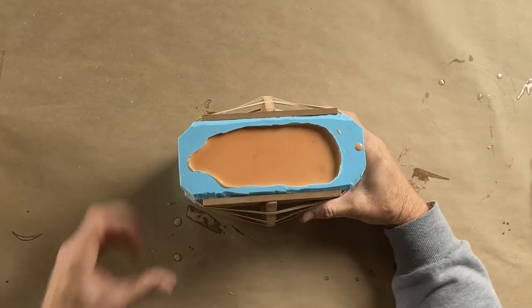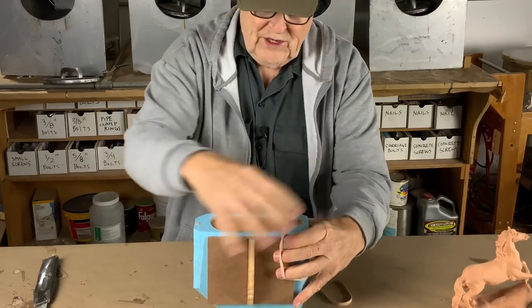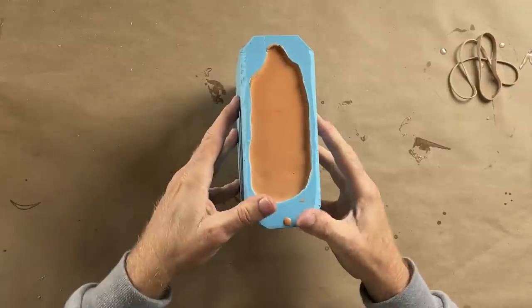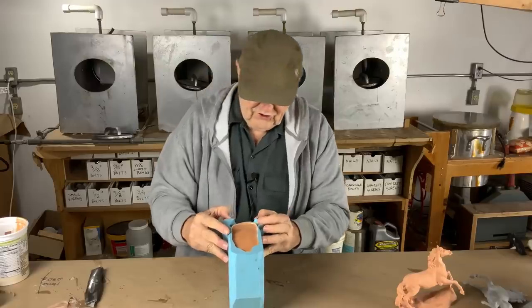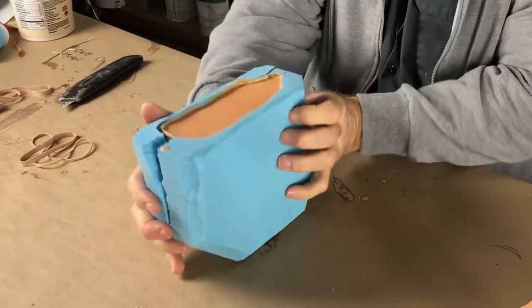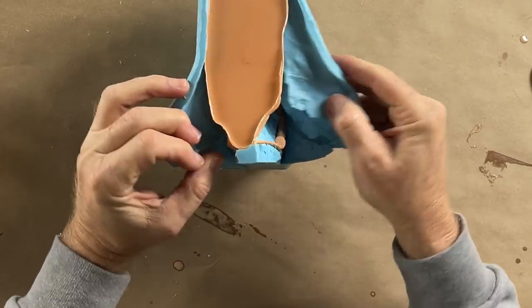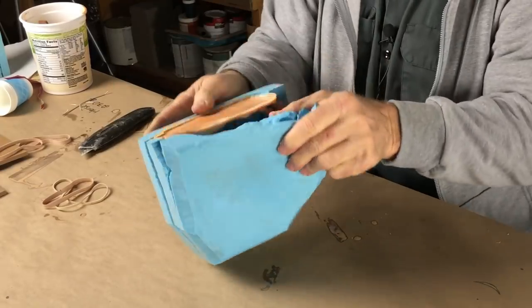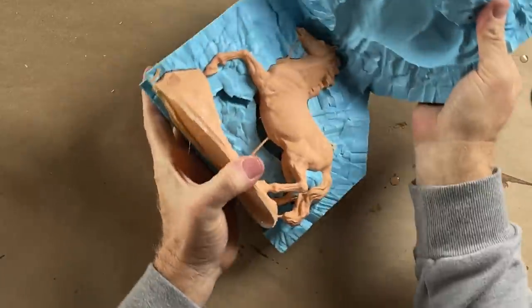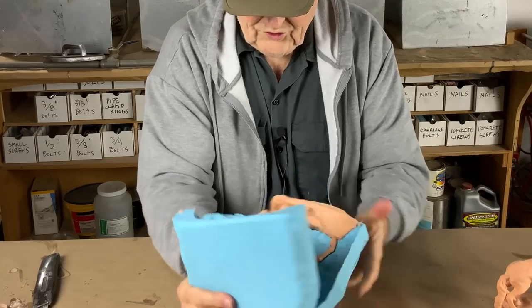The witness cup is perfect — hard as a rock. Pulled it out of the tank. This is the second casting, single pour — let's take it apart and see what we got. Pulling it apart — tail cast good. That front sticking-out hoof is filled and the whole vent filled — that's a good start. Got one interesting area I'll show you in a minute. Pop that out — look at that. Very cool, nice.